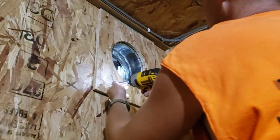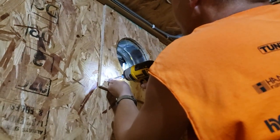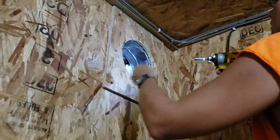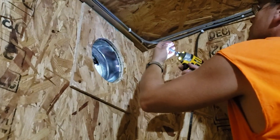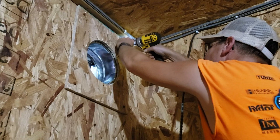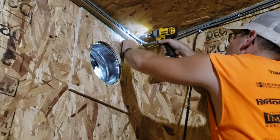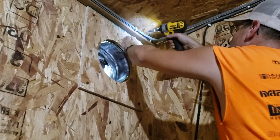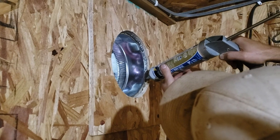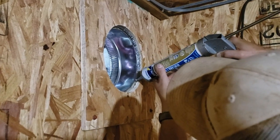I'm also up towards the roof line, so even though it doesn't show in the pictures, there's a four-inch overhang and then another four inches of gutter above this shutter, which gives it a lot of protection from downward rain. Unless you get a real driving rain at the shutter itself, it really won't push rain into it. I really want this to run on humidity so that in the summer it'll turn on when the temperature gets to 90 degrees, but also in the dead of winter if the goats are breathing hard and humidity is high, it'll kick on for that too, regardless of temperature.